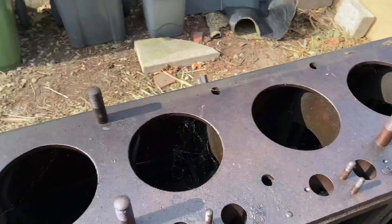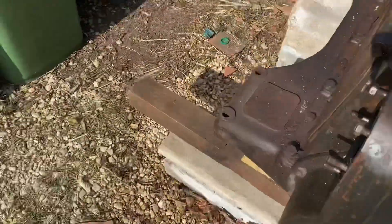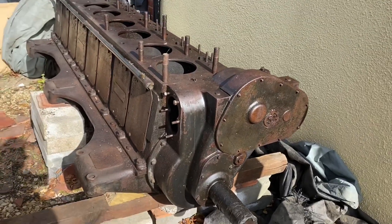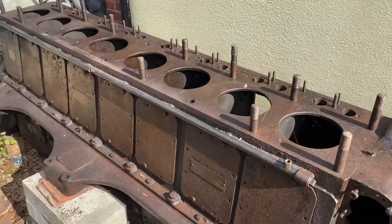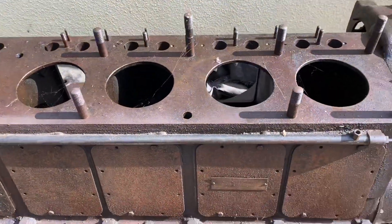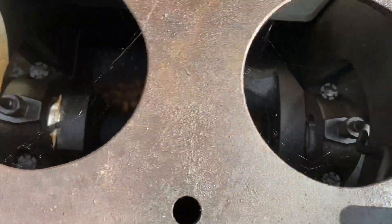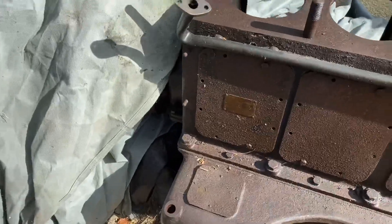This is about 200-odd horsepower, but at about 1,000 RPM. The full engine's about four tonnes. I think this weighs a good ton, and I've got a drive shaft for it as well in the garage and a big pulley on the end of it. You can see it's all been wrapped in wax rag, so hopefully some of those surfaces are okay, but the reality is that crank may need to be re-ground - but until you take it all apart, who knows?